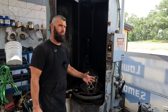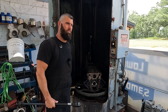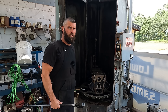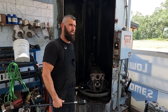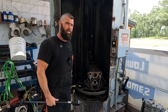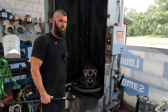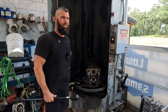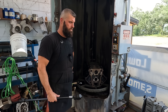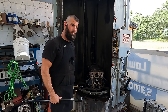So with that information, I guess we could assume without too much trouble that we should probably run aluminum blocks about a half a thousandths tighter than iron blocks. A half a thousandths ain't the end of the world, but I really didn't think it would be enough difference to amount to anything — but half a thousandths is half a thousandths. I think that's good information.